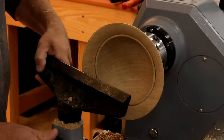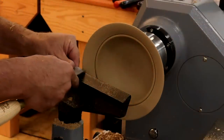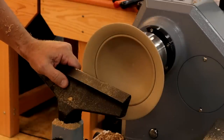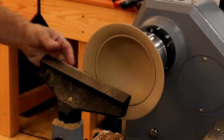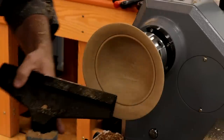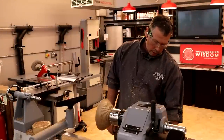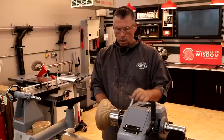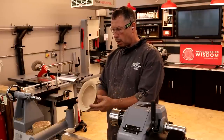Stop and do another check. I always say it's important to look with your hands first before you look with your eyes — your hands will give a lot away and tell you when things aren't quite right. That will do us. Artful Bodge has been on saying he's learned something this week with the backing out for the next stroke when bevel rubbing. Every single day I find I'm picking up new bits of information from different turners, even from beginners — everybody's got something to contribute when it comes to learning how to turn.